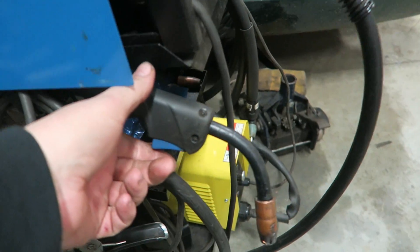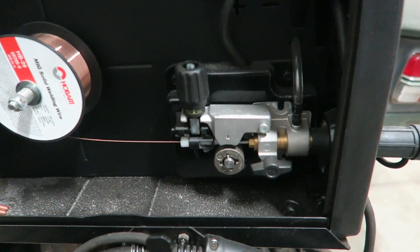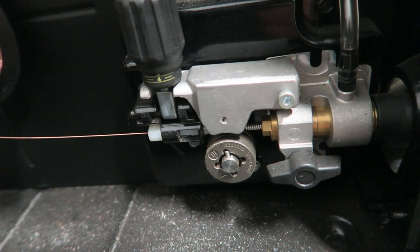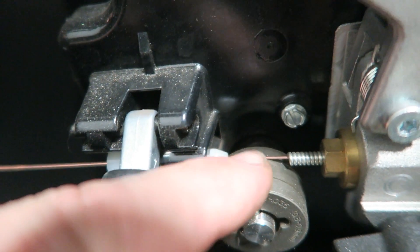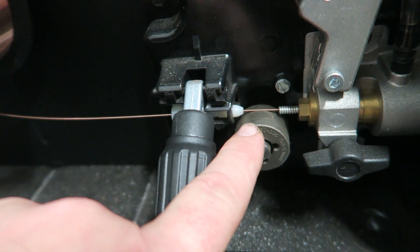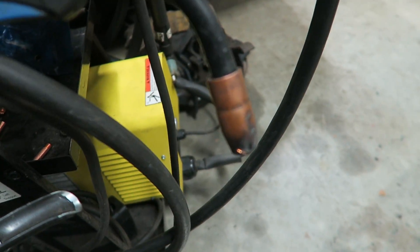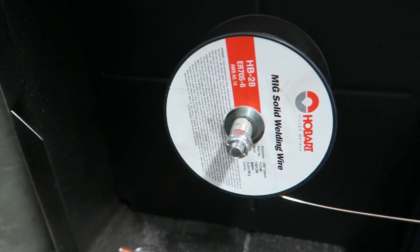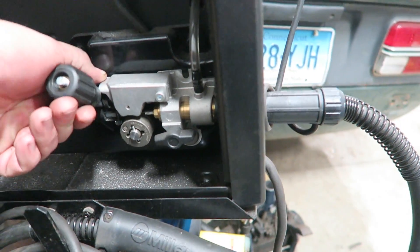The metal that you're seeing in here is all the filler metal that came out of the welder. How does it feed the wire? Well, on this torch is a little trigger. When you pull the trigger, it activates this mechanism right here — the wire feed mechanism. It's got this little clamp that clamps down on top of the wire with this little thimble. When you pull the trigger, this little thimble spins and feeds the wire down through here, around through this entire cable, and then it runs out of your MIG gun. It gets the wire from a spool inside, pulls that wire through, and pushes it down. That is literally how simple a MIG welder is.